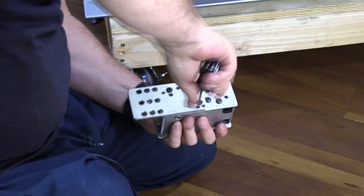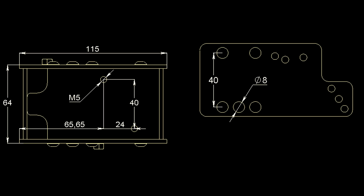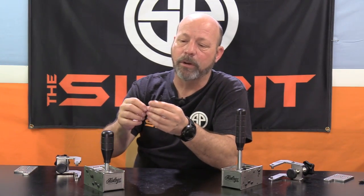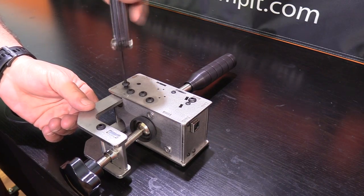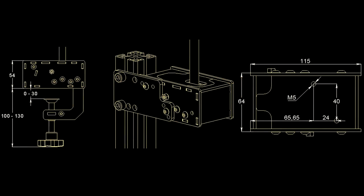It's amazingly solid — even in the vertical position it's just hanging in the air but rock solid. The M5 hardware mounting holes on the bottom are 40mm apart. The rubber gaskets give a really nice firm grip and prevent gouging of the desktop or whatever you mount it to. It's quick and easy — just two bolts — and it clamps onto up to 1.18 inches or 30mm thickness. I'm really impressed with the mounting options and that they all come included.